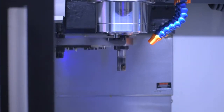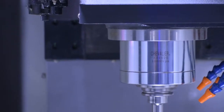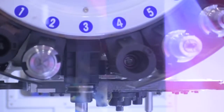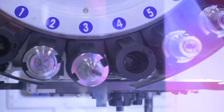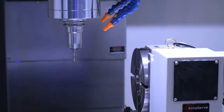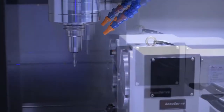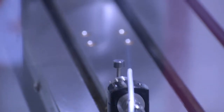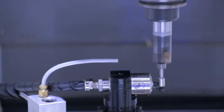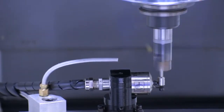The EM2040L has a 20 horsepower motor, 10,000 RPM. It has a 24 tool ATC. It comes standard with a chip auger that goes in the X direction on the front of the machine. It has a nice spindle curtain to make sure your part stays cool. Right now at the show, we have an optional 4th axis rotary table and an optional Renishaw tool presetter with the optional spindle tilt.